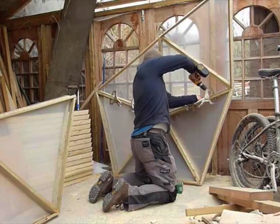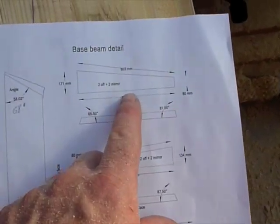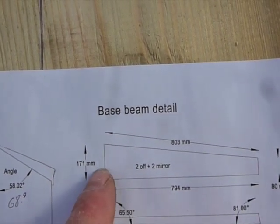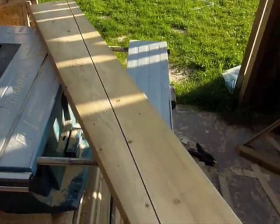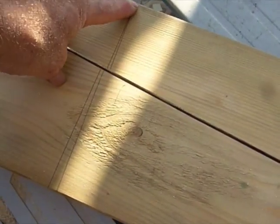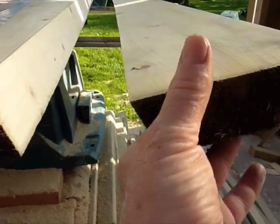I'm going to put a few extra screws. We're going to do the base for the GD5 now. This is the plan of the base. It'll give you measurements at the top and measurements at the thin end — so it's square here and there's this angle cut. We'll cut that first. I've marked it on my piece of wood. I've got a piece of wood that's a bit thicker, so I've marked it — one piece runs here and the other piece runs here by that pencil mark. I've pushed them together so that we get two pieces out of one section of wood. I've put that through the saw. The saw's set to the angle on the plans.